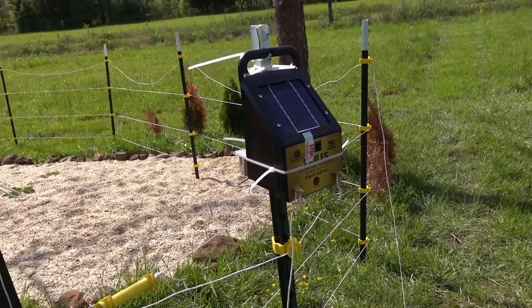The whole thing costs certainly less than $200. The basics of an electric fence: stake off a bunch of perimeter T-posts, add plastic standoffs. You can do this with any number of different kinds of posts — if you have plastic posts, you don't need the standoffs because there's no ground contact with metal. But I wanted something more sturdy since it gets fairly windy out here. The solar-powered controller is right here so I can shut it off from outside the gate.